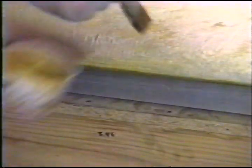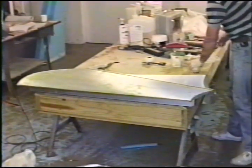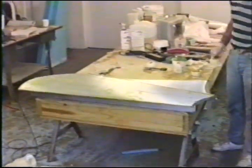The jig here of the leading edge was placed just far enough back so as not to encumber your progress as you go to wet this out. A little light down here certainly wouldn't hurt, and a mild application of heat in these areas will help you wet them out. At this stage, it's just like the rest of the laminate. You have a glass-to-glass transition at the back end you're going to wet out, and its entire length, and we'll do a cut there. And the next time we speak to you, we'll be pulling the bag off.